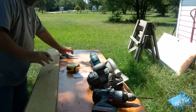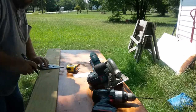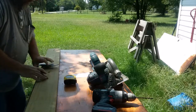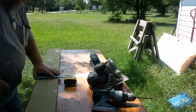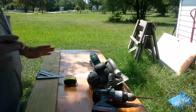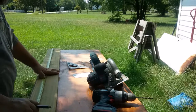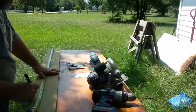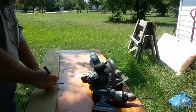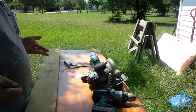Two of these pieces will be for the walls, and the other eight inch piece will be for the floor. I like a little porch form, you know — sit outside and talk about all the other birds and what they're going to do when they retire. Now I'm going to have two pieces at four inches for the walls. You can see I still got quite a bit of board left — you can make this bigger or smaller, however you like. This is how I make them, and if you cut all these pieces at the same time and do batches, I can turn out four to five an hour.